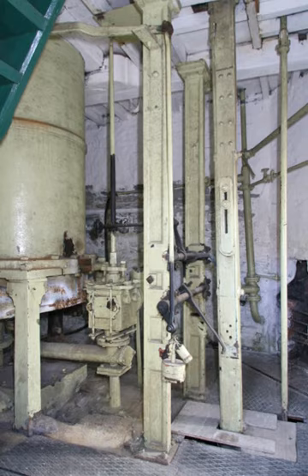The cataract itself resembled a small plunger pump. It was an iron box in a cistern filled with water, with a plunger or piston set in the top and pressed downwards by a weight. The water within the pump could only escape through a small tap or valve. As the plunger gradually fell, its motion was passed upwards by a rocking lever and a rod to the valve gear in the middle chamber. Once the rod had risen sufficiently, this opened the first valve to admit steam into the upper part of the cylinder, beginning a new stroke. Once the stroke had begun, the cataract's rocking lever was pushed downwards by the engine. This lifted the plunger, which acted as a suction pump within the cataract to refill the plunger box through a flap valve from its surrounding cistern. The cistern was kept filled with water by the pump that the engine itself was working.